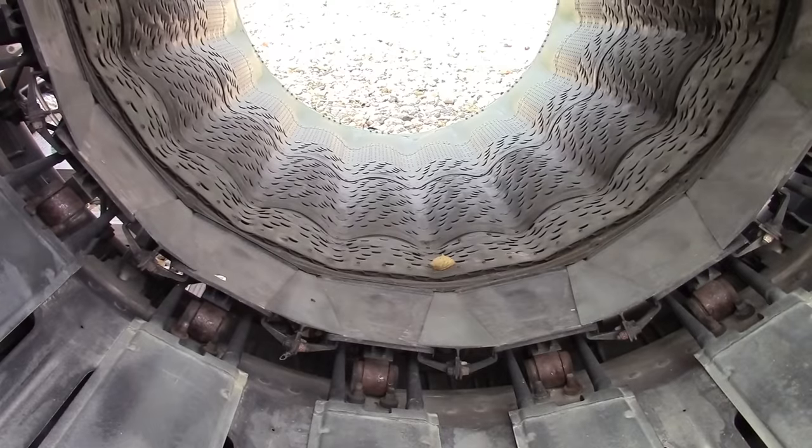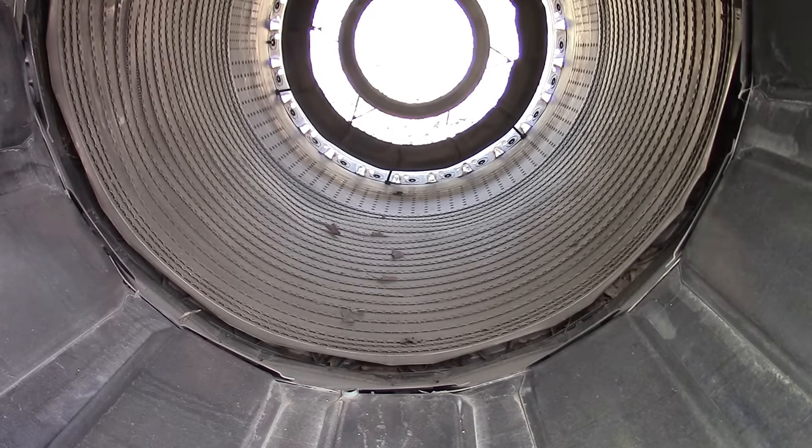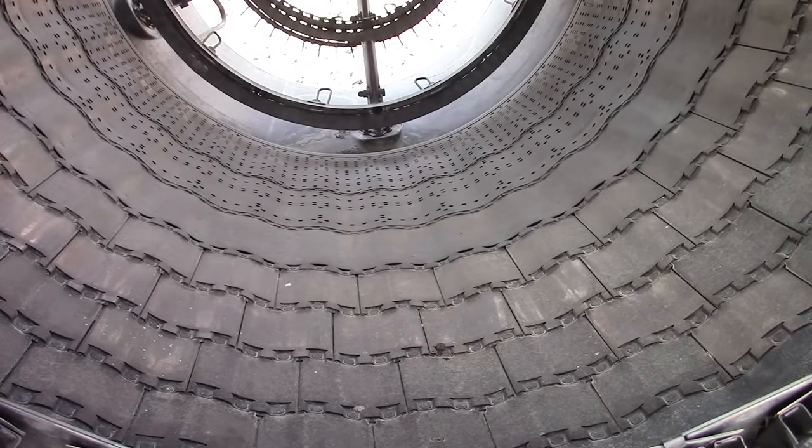This one has the liners all the way forward, and you can see those little dimples are caused by the punching of the sheet metal to make small openings to allow cooling air to bleed through — presumably to maintain a layer of air between the metal and the flame. Looking up the back end of the F404, there are many more cooling air holes in what are sometimes known as 'wiggle strips.' You could say it's more sophisticated, more finely crafted, more high performance — out of a CF-18, which is almost identical to the original FA-18 Hornet engine.